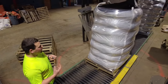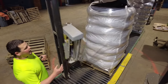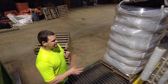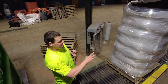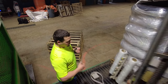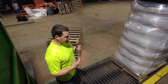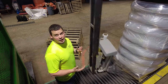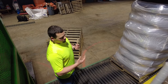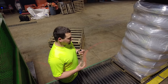I'm a big believer that you have to shrink wrap every single pallet. Some people believe that if it's in a sack it doesn't need shrink wrap — but I've seen too many of these fall over from inexperienced operators. The tighter the film, the more we put on, the more stable the pallet, and the better the quality.